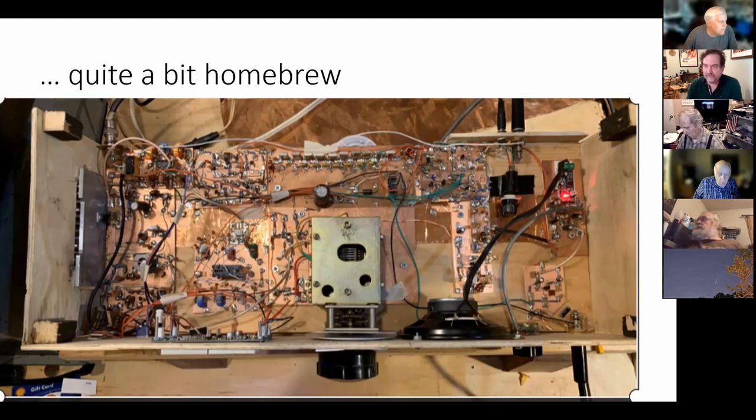Yeah, you could do it. There's a lot of different ways to do it, depending on what kind of gear you have. But the G3UUR method and Chuck Adams, and then you go to the software, and you go back and forth between the software and then what you build, and you measure it, and you test it and everything else. For example, I built it the first time and I found it was a bit too narrow. So I changed the series capacitors. I bought some additional capacitors. I think I lowered them in capacitance, and that caused the filter to broaden out a bit.